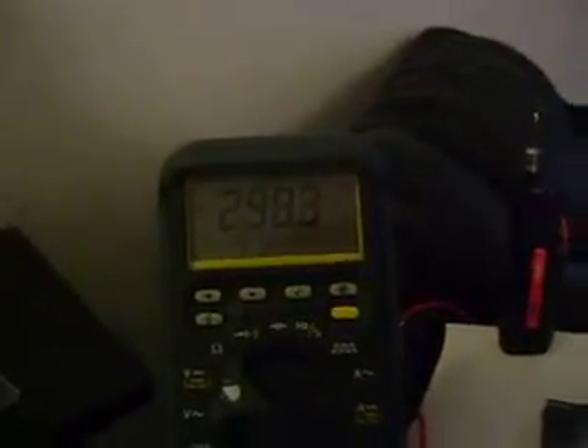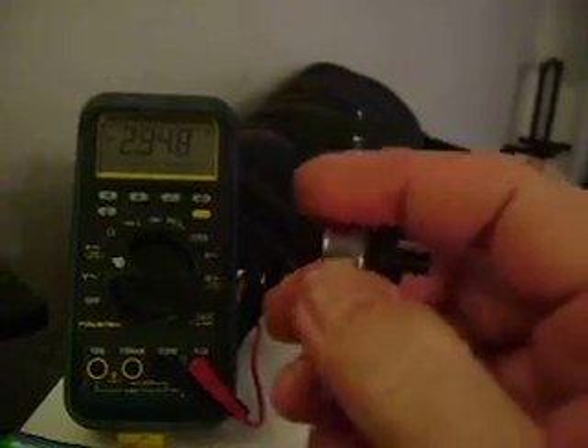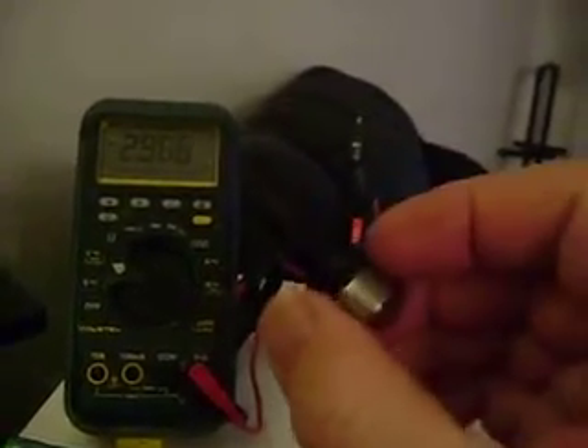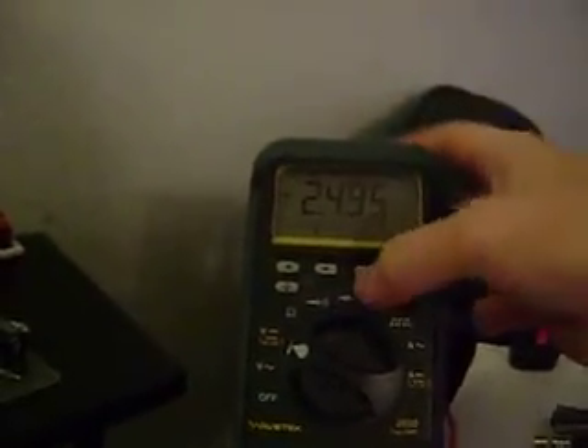Now it's just five volts going into the red coil, pulsed. We got an N52 magnet, three quarters by three eighths. I had to put a little more spacing on this — actually I need more. I need to make a rig to adjust where these magnets are, but I'm going to turn this to a noisemaker.